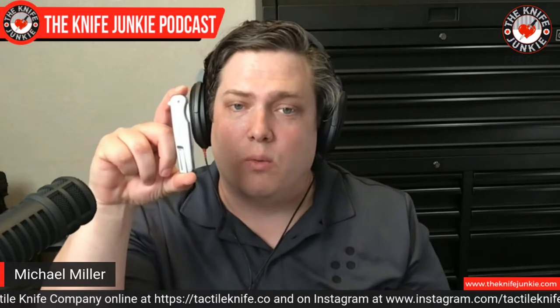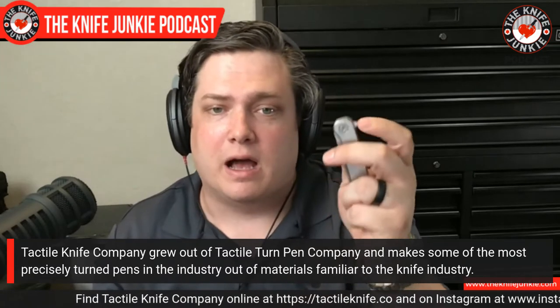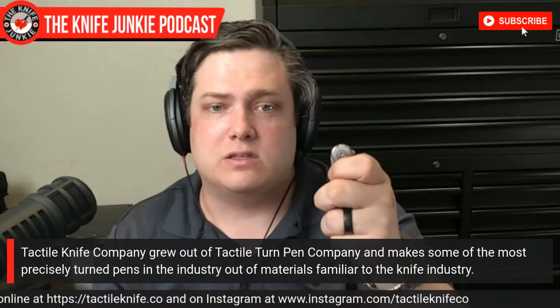One of the biggest issues is the amount of moving parts and components that have to function well together. With a pen versus a knife, there are fewer components, there are fewer moving parts, and there is a looser tolerance to some things — less stacking tolerance. Each pivot screw screws into a pivot body, that pivot body houses your blade, your blade is touching 12 ceramic ball bearings on either side, and that's all encased with the two handles. If those components don't go together just right, you're not going to get a strong, smooth action.